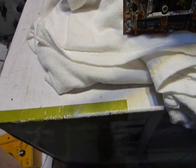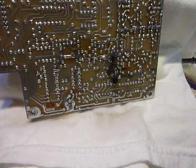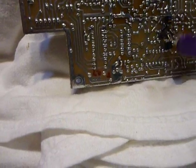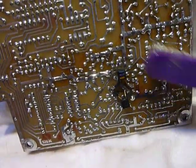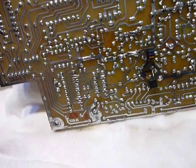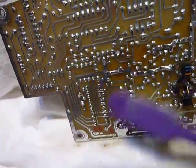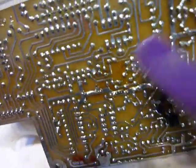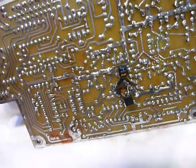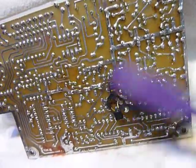I got the top side done pretty well in the area I wanted. Now we'll go to the bottom side of the circuit board, where I'm going to use an old toothbrush. Here's where I put those new diodes — those are MV107s. I replaced the ones inside the VFO can by soldering them on the bottom of the board. It's quite common to put parts on the bottom of the board — someone discovers they need a little capacitor or resistor and solders it right there. No problem with that.